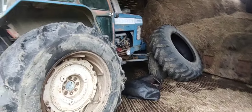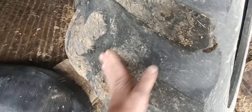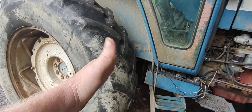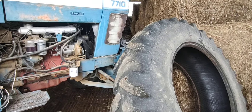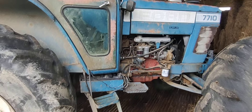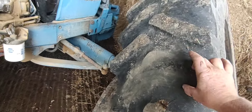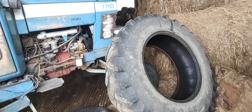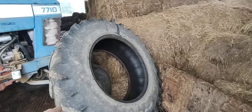We're going to start with the Ford since yesterday we put a new tire on it. As you can see, really no tread left — these treads are wore down. There's about 5,000 hours on this tire. That's the second set of tires I've put on this tractor. They originally came with Goodyear Dyno Torque Twos — long bar, short bar pattern — my opinion, worst tires ever made. They didn't even last 1,500 hours. Then I put Firestone 23-degree radials on and got about 5,000 hours out of that set.